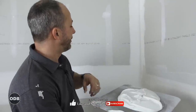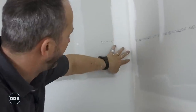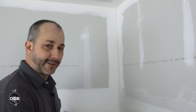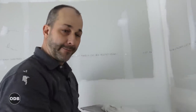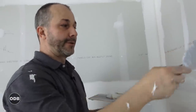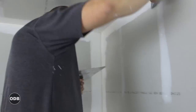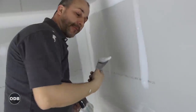On your third day working in your basement you want to do the rest of your inside corners. You'll see here this mud is actually still wet — you can see the dark line. We don't want to do that one, but the ceiling looks perfect. You want to do your inside corners as soon as you can because sometimes they take an extra day to dry out, especially in the basement. You're below grade, there's not as much place for the moisture to go because it's on a vapor barrier wall.